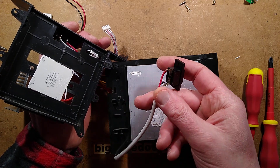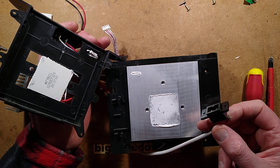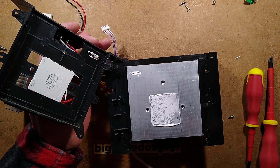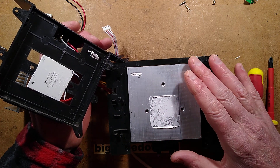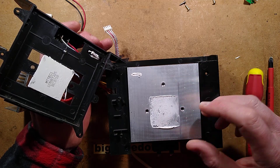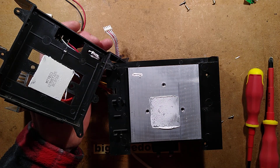There we have it. It seems a design flaw that a better thermal transfer sticker or compound would have been quite good there. We've taken it apart, we've seen inside, we've seen the problem. Interesting devices, but just not very efficient. If you want a real dehumidifier for a proper house application, get a compressor-based one. If you're in a very hot or very cold environment, get the desiccant drum ones — they'll pay themselves off in a relatively quick time because they're just so infinitely more efficient at drawing water out than these solid-state ones.